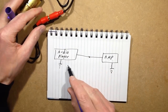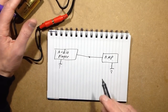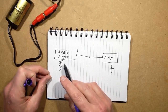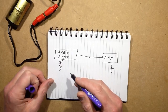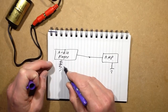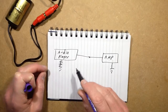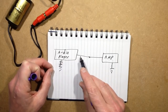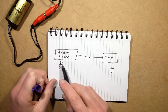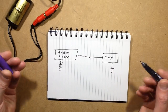You can basically get a slight mains voltage difference at 50 hertz or 60 hertz, and it causes hum. And another thing that causes this is some of the equipment is not earthed. It's double insulated. Think of your laptop, for instance, which might not have an earthed mains adapter. So you've got that situation where the live and neutral is coupled across the transformer inside the switch mode power supply with the little capacitor. And you'll end up with all weird electrical hissing noise, like the switch mode noise and mains, just a whole mishmash of noise. And it can find its way across this cable, and it can basically be interpreted as audio, and it can create hum and noise.